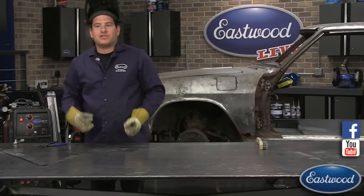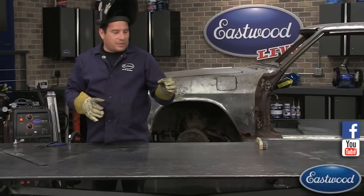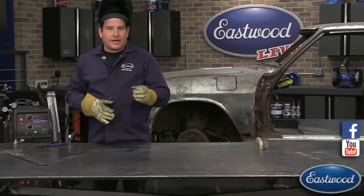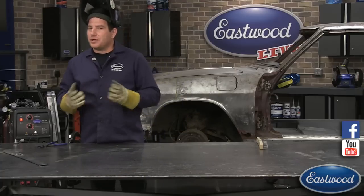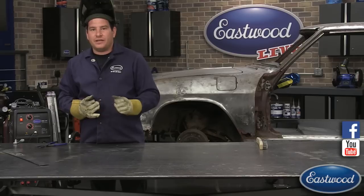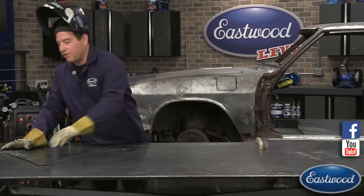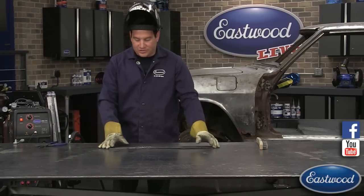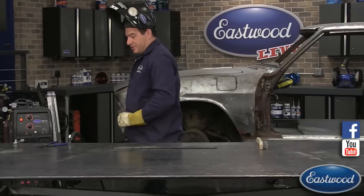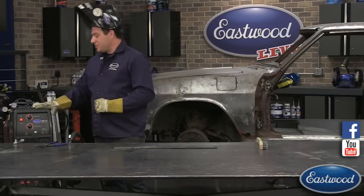If you're seeing a lot of excessive sparks, and big flying pieces of molten metal that are hitting and kind of exploding, you've probably got your wire speed set a little too high, because it's shooting excess wire all over the place. It's probably going to get you on top of your head too, because it's going to bounce over you, which isn't good. Any other questions we have as we're moving?